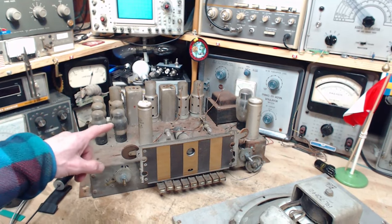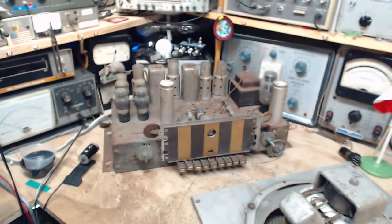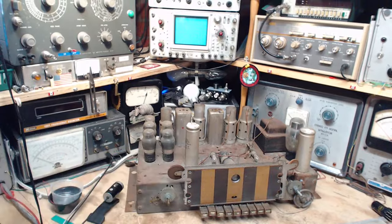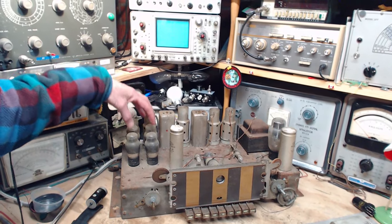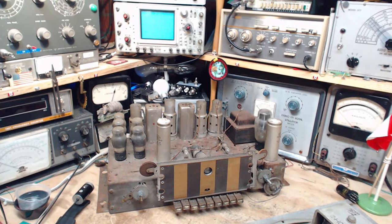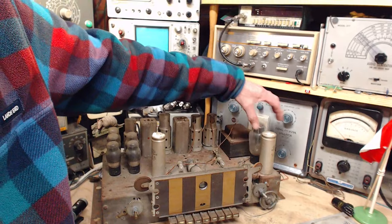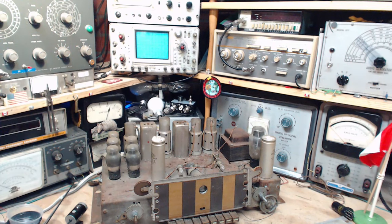For the filtering of the power supply in these radios, the bulk of it, in my view, is done in the field coil, or choke coil, if there happened to be a choke coil in the power supply. And that makes the filter capacitors, this has got to be one, this is probably the other. Why are they so far apart? Why'd they do this in this radio? They clumped everything together here. All these tubes are just clumped together. You'd think they'd spread them out a little further, a little bit cooler. Some of them are wired together, so there's a reason for them being close, but why this way over here? Are they doing totally different things? This is the rectifier tube, and this has got to be part of the power supply. Here's the transformer, rectifier tube, filter. What's this one doing way over here? Maybe this one is a bypass capacitor for the output tube cathode resistor. I don't know.